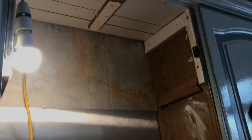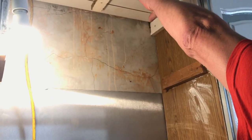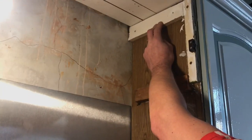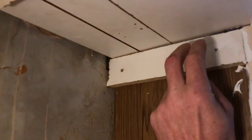Also, one thing that my daughter's brought up is not everybody has an old cupboard that they've ripped to bits. So basically you can use ply, MDF, whatever you want, just to fill a hole, so the stuff that your wife throws on top doesn't fall through, which it did. Obviously, you don't see all this, so I've just used what I could find. Probably the cheapest thing to use would be tile batten. She's saying upcycle the cupboard that I took apart. Tile batten, just make sure you drill it, because it can crack quite easily.